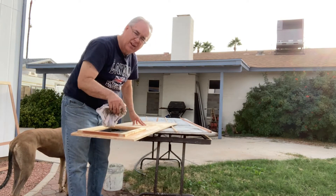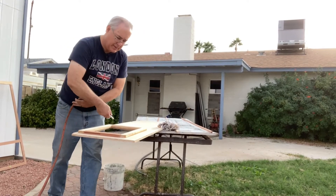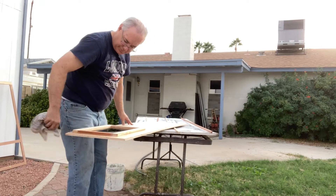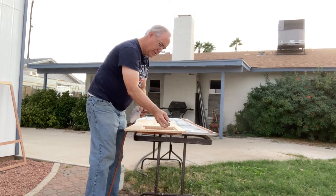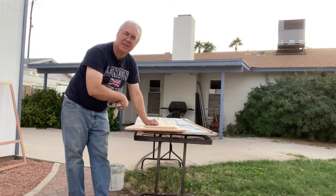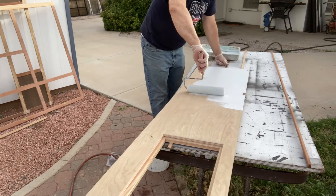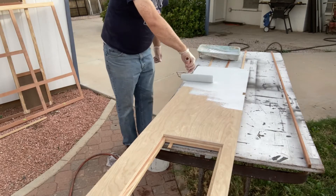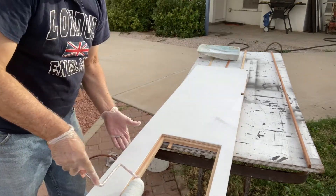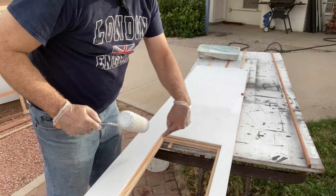I think we're going to get our air sprayer to get all these little cracks. We're back with just a little bit of air — want to make sure this piece is nice and clean. Now we're painting the surfaces but not the edges, because the edges are where it's going to be glued, and glue doesn't stick to paint. I'm going to save the inner edges for the sprayer. Rollers are great for flat surfaces and sprayers are good for inner surfaces like that.